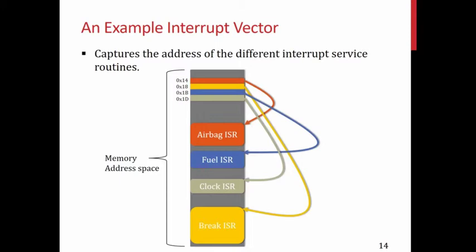So this concept must be very clear. A lot of you will still have this question in mind, where do I call the interrupt? You don't call the interrupt. It happens automatically. It only doesn't happen automatically if you mess up your code. So in your lab, if it doesn't happen, it means you have not put in the correct entry in your vector table, or you have not done the correct mapping and so on. As long as all your mapping and registers are correct, this whole process is automatic.